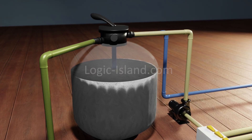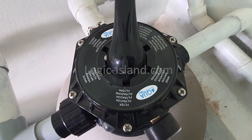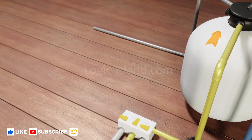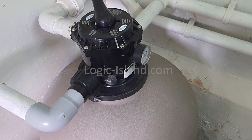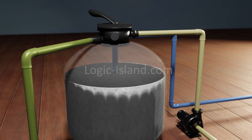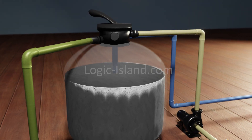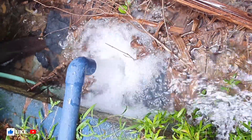Now that we've explored all modes of filtration, let's see what eventually happens to the sediments and waste collected inside the sand filter. The sand filter unit houses a specialized valve called a multi-port valve, which can divert the flow of water entering and leaving the filter into different directions, all through a single handle. In the usual mode of filtration, the multi-port valve is set to filter mode. The multi-port valve has another setting called backwash, which when selected will cause water to flow in the reverse direction inside the filter. This causes all the sediments and waste trapped inside the sand to be washed out. Instead of pushing the sediments back to the pool, the backwash mode diverts them through a separate channel into a distant pit. After running the filter in backwash mode for a few minutes, all the waste collected in the sand will be gone. We typically perform backwashing once a week, and it takes approximately 500 to 1,000 liters of water to run the filter clean.